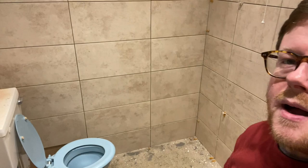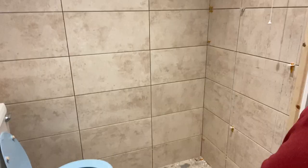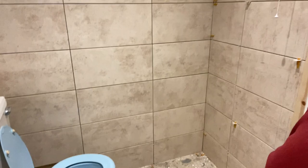I have tiled some of the bathroom now - let me show you! I've started tiling with my tiles from Wickes - these are 30 by 60 city stone beige tiles. I'm fairly happy with how it's gone. There are a few bits I'm a little dubious about, but because the walls are bowed, what you should really do is get a plasterer in to level everything first so you're tiling onto a perfectly level surface. Because I was trying to save money and do it myself, I didn't do that, and I've realized I'm tiling onto a curved surface, which is a bit of a pain.